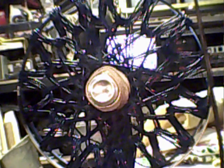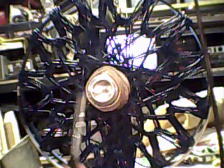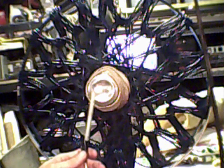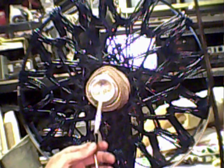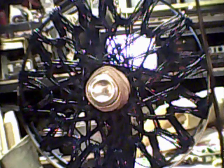I've got two versions of high voltage testers — they're real easy to make. You can get your ink pen and an old flash bulb, put the flash bulb down inside there, one end goes to ground and the other you use to touch your source to see if you've got high voltage. You can see that thing light up. Let me kill some lights here so you can see this better.